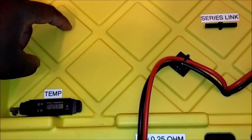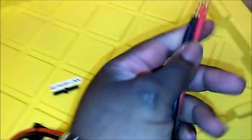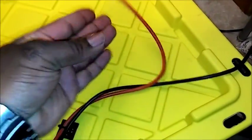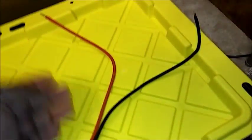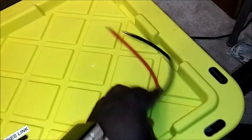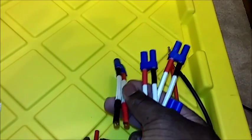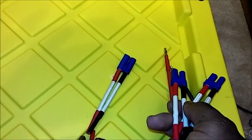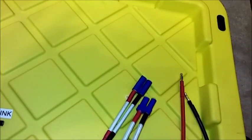There are 10-gauge silicone wire leads soldered to it with 4mm bullet connectors on each one. The reason I chose 4mm bullets is that most of the time when people order power supplies they come with 4mm bullets, so I can plug directly into them. If an order doesn't have 4mm bullets, I have an assortment of adapters — including 4mm bullet to EC5 for Power Lab and 4mm bullet to EC5 for iCharger.